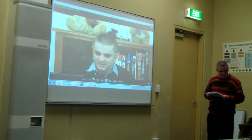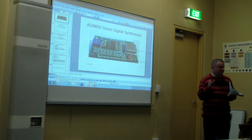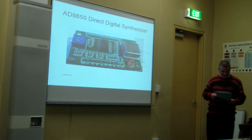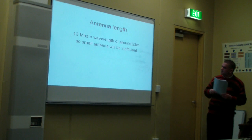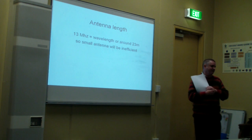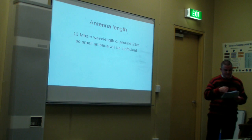Okay, you'll notice a few little differences there. I actually used a different GPS for this prototype. I was using RTTY for my prototype. Now, can I have the next slide, please? Right, and you also note that I used 13 megs, which is the ISM band, industrial, scientific, medical. It's a little less restrictive than amateur radio requirements, and actually ideal when you use it. So these frequencies are free to use, provided you use the very low power that is specified in the regulations.